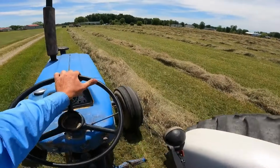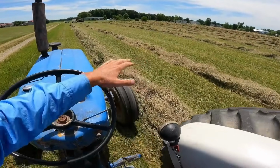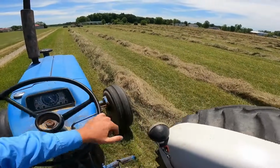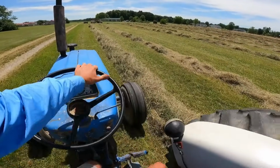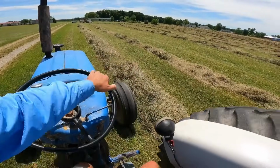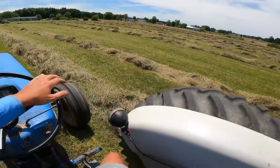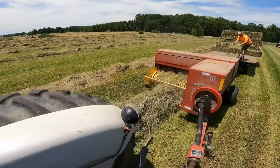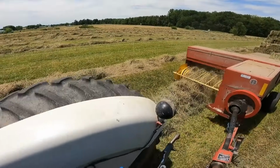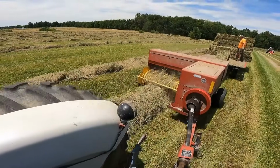I need to check on mow height. It's consistent. The disc bine definitely is consistent, where sometimes with the sickle machine, if the grass was soft or not a long height, there's a bit of variation, where not every blade was the same height. So I might have mowed it a half-inch taller, but every blade looks like it's exactly the same height out there.